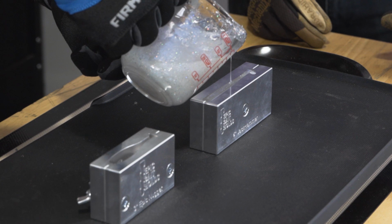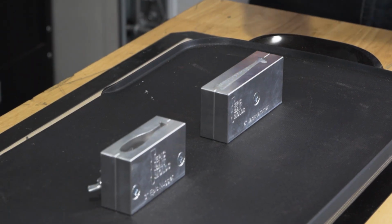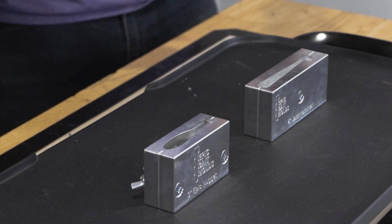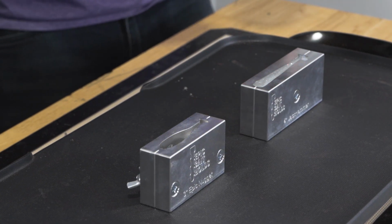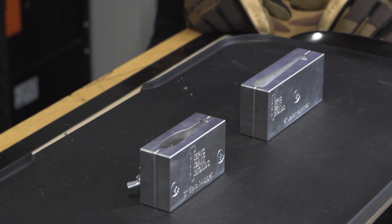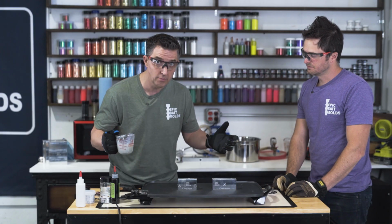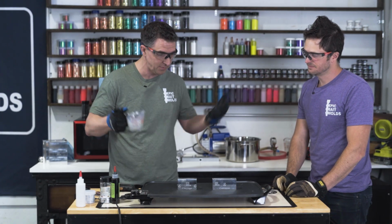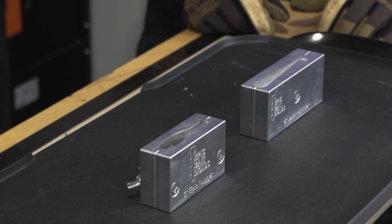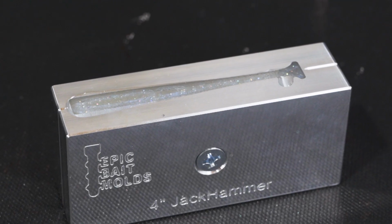So as he's filling this up, you're seeing he's bringing it to a nice little crown over the top of the mold. Yep. And don't worry if you get a little extra on the edges like this, we can just push on that when it's all cooled, and that'll come right off. Yeah, because it's an aluminum mold, right? So the edges are gonna be nice and sharp, so that if you do get a little overpour, which you're going to, because you just started, everybody does. I've been doing this forever, and I've got overpour all along there. But it's really simple. You just take your thumb, push it right against that sharp edge, and it looks nice and clean. Yep, and we'll show you that in a minute.